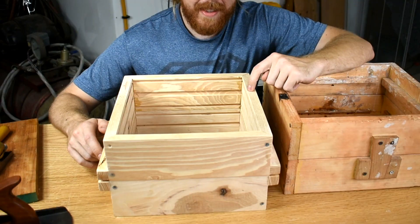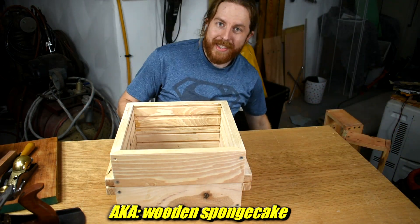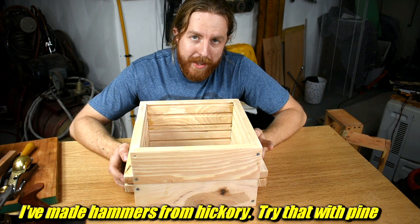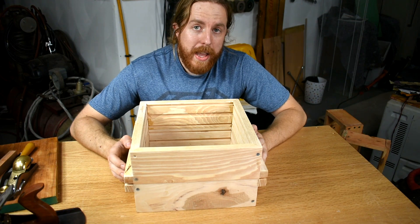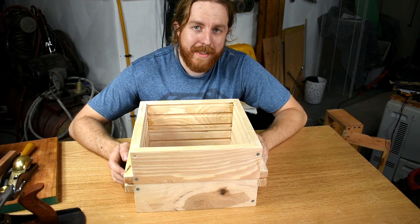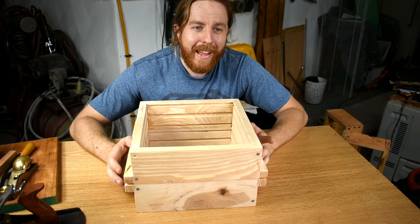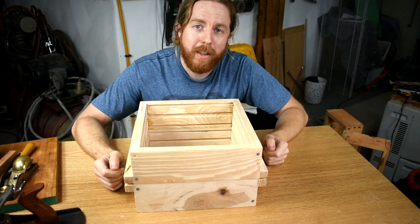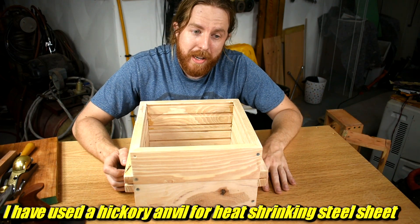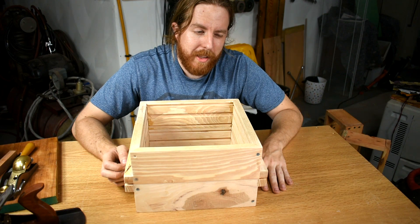The main difference: this is hickory; that is construction garbage lumber. It can be fairly difficult to describe what hickory is like to someone who has only used pine and other construction lumber. You have to pre-drill holes for this, not just because it would split, but because there's no way you're driving a screw into hickory otherwise. Hickory also has very, very high bending resistance — it is very difficult to get it to bow out. Pine is kind of like Twizzler candy; it's very flexible when it's really long. I also suspect hickory is probably better at taking the extra heat, though I have a test coming up to confirm that.